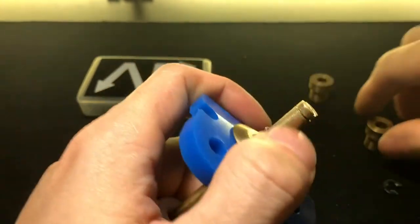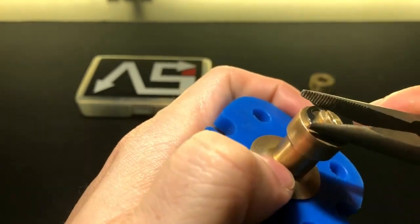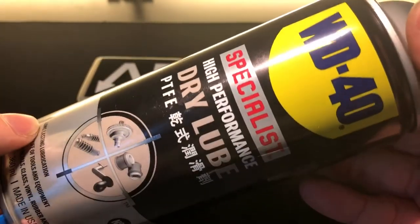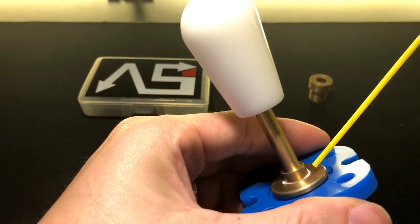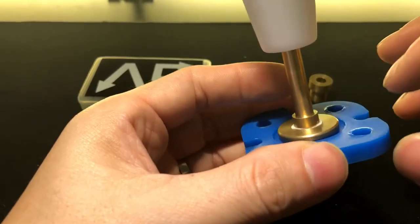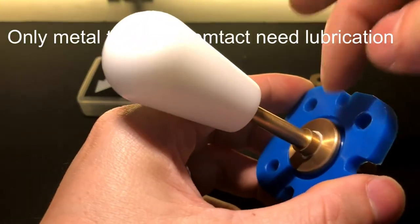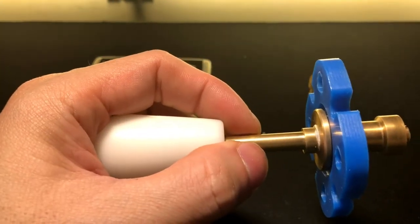I'll use the lightest spring now. If you want to use spray lubrication you can try WD-40 spray lube made from PTFE or Teflon — just spray a small amount on the friction area. You don't need to lubricate the silicone because this is not metal-to-metal friction, this is metal-to-rubber, so there's no friction. You only need to lubricate the area where metal meets metal.